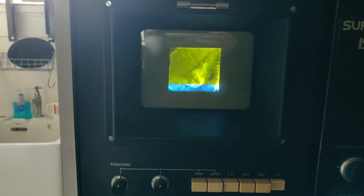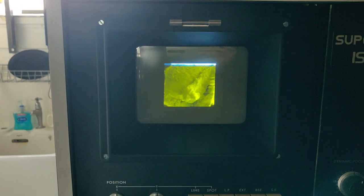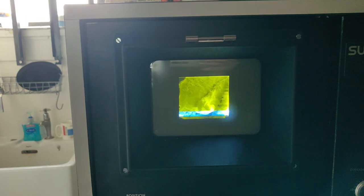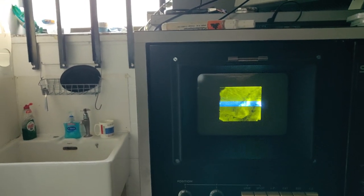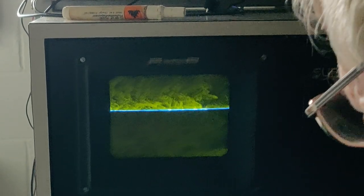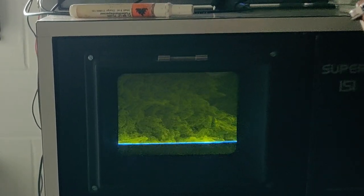See, as the filament saturates, yes. If it's under saturation, the beam will be slightly off the axis and not coming from the point of the filament. And what Dick is doing is saturating the filament so that no further increase in current produces no further beam. That's saturation. And the phosphor retains the image, whereas nowadays, it's all stored in digital mode. But just there you can see the difference.